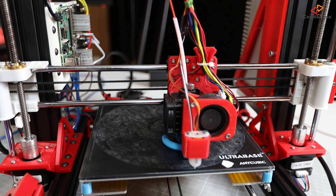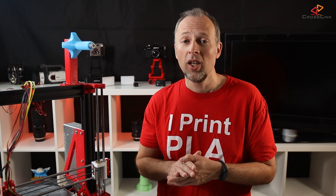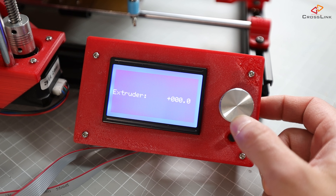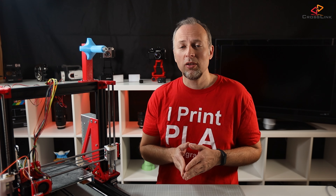Finally checking the Z movement — if I try to move it up, it's moving up. That's correct. The only motor left to test is the extruder motor, and to test that we need to heat up the nozzle first with some filament inserted. Once the temperature has been reached, I'm starting to extrude some filament. It's moving in the right direction, but it might be different for you, so really do every check for every motor. All motor directions are correct, so let's upload a new build to the mainboard now to fix the motor direction changes that we just made.